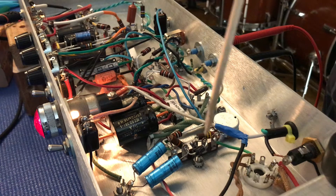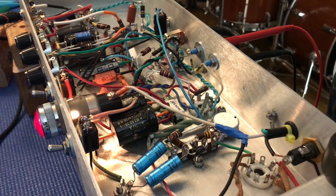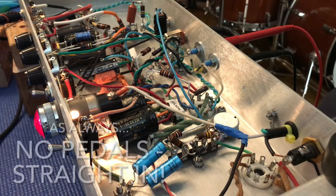The amp was originally built as a fixed bias amplifier, with a switch added to switch between fixed and cathode bias — so these components were added along with the switch. Right now I've got a 5V4 rectifier in there with two 6V6 output tubes drawing approximately 27 and 32 milliamps of current respectively, and the amp is in fixed bias mode running through a single Celestion Gold speaker.